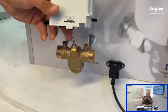And remember, the grey wire of the valve is connected to the satisfied of the cylinder stat, and also the hot water off terminal on the programmer, generally terminal number 1. It certainly is for our backplate. So again, sequentially you would pick through removing links and seeing when that terminal goes dead, because the problem we've got here is we are calling for water, and yet for some reason the hot water off side of our circuit is energized.